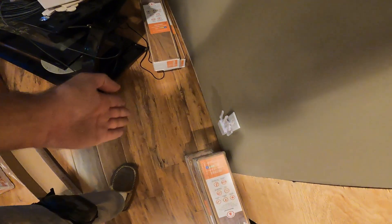I started this project on Sunday afternoon. What I ended up doing at the start was I used some leftover one-by-sixes cut down to about a foot, stuck them between the wall and my first layer as spacers. Once I got about six or seven tiles out, I could push the whole floor back against the wall — and there's plenty of room behind the half-inch drywall for that floor to fluctuate. I'll put trim on top and you won't even see it.